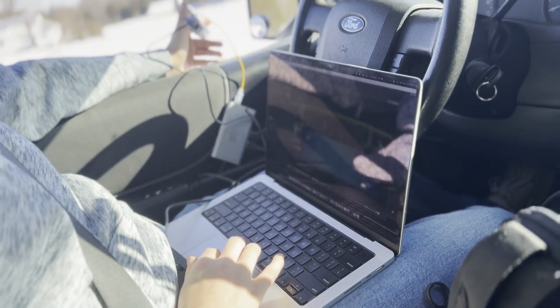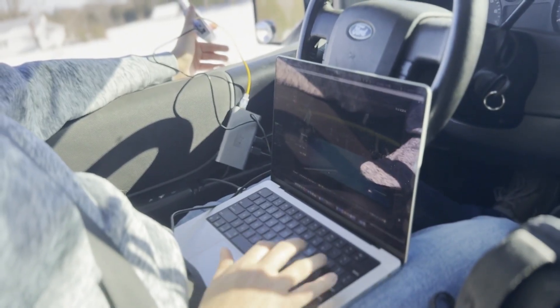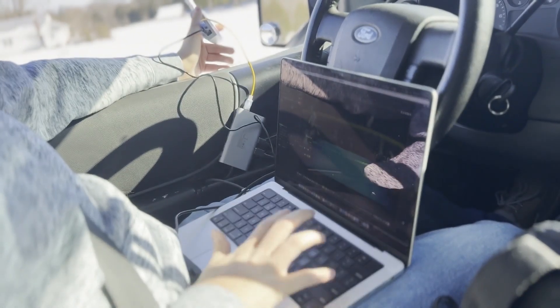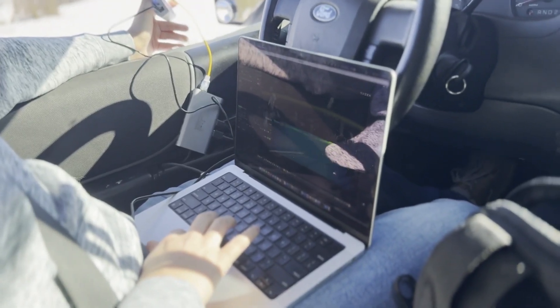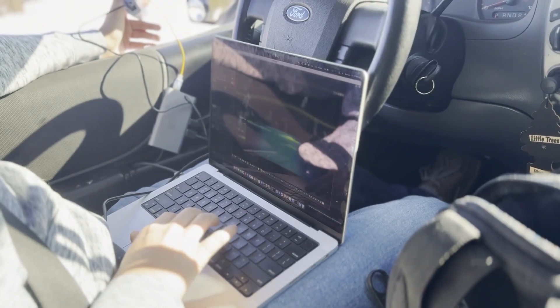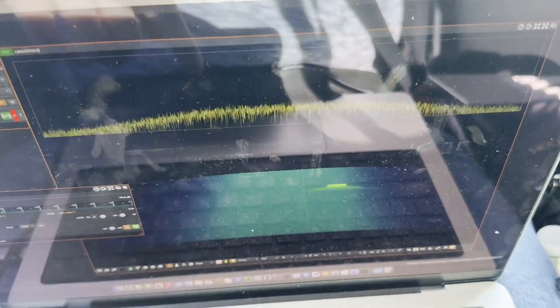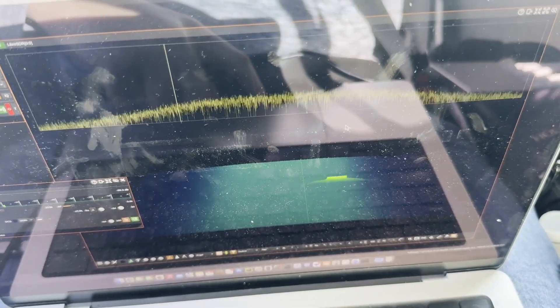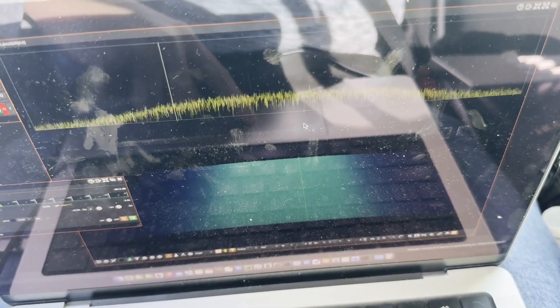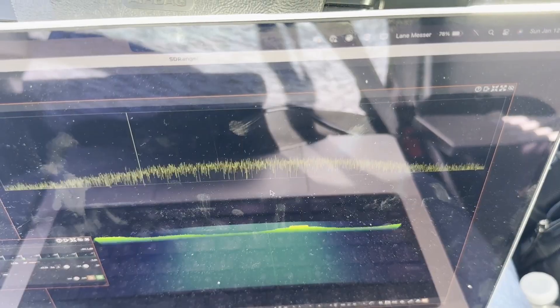There it is — 915 MHz. That looks kind of more like 900 and something. There are so many spurious emissions, it's just crazy. That may be from the receiver side trying to transmit back. Yeah, there's a lot of spurious emissions for some odd reason.